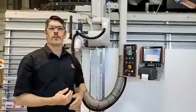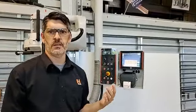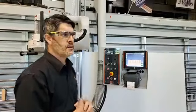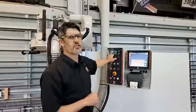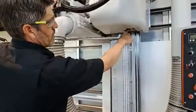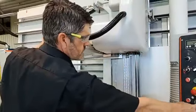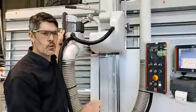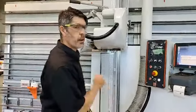Now, a horizontal trim cut — we'll be doing the trim cut the same all the time. Typically we have a 4x8 sheet, which is actually 49 inches, so everything is one inch bigger. So our first cut is normally about 48 and a half inches. Instead of having to find it on the digital or manual scale each time, we have a quick stop — just a very simple mechanical quick stop. These cams right here. I can come down to it, lock it in place, and every time do the same trim cut. No thinking involved, very quick setup. Now we'll make the cut.